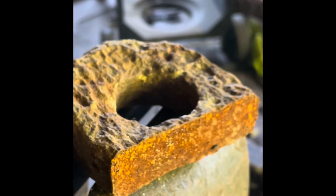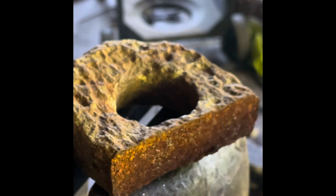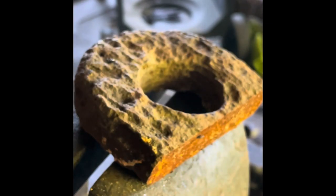That's another indication that you're dealing with wrought iron and not mild steel. Hopefully that helps clear that up and helps you on your quest to find some wrought iron. Save it for a special project though — wrought iron is no longer produced. I think there may be a company that recycles wrought iron and creates bar stock from it, but for the most part wrought iron is no longer available except for salvage material.